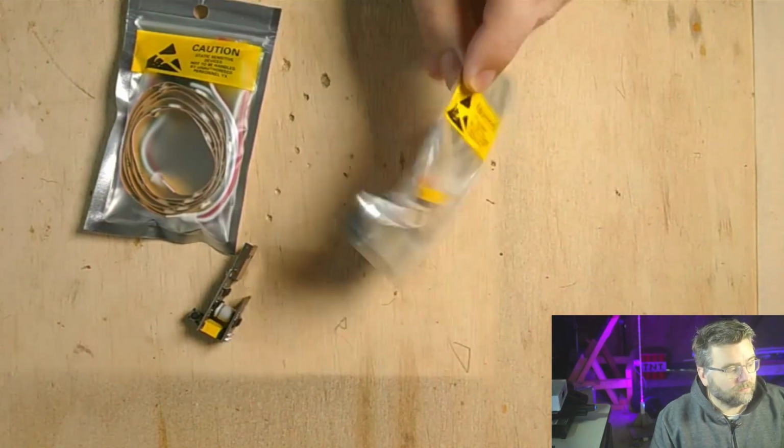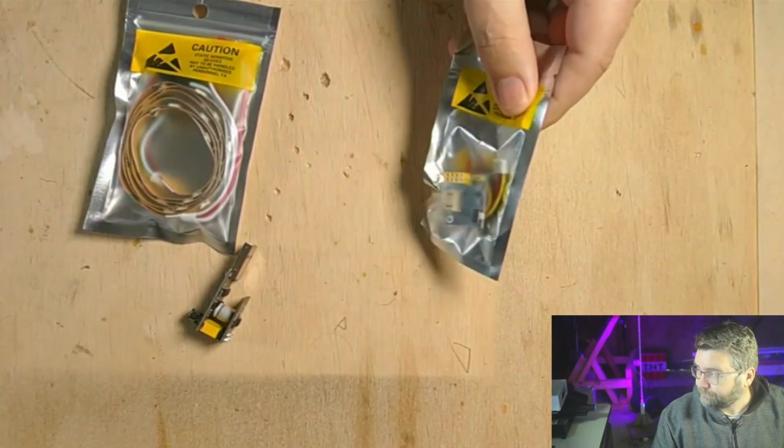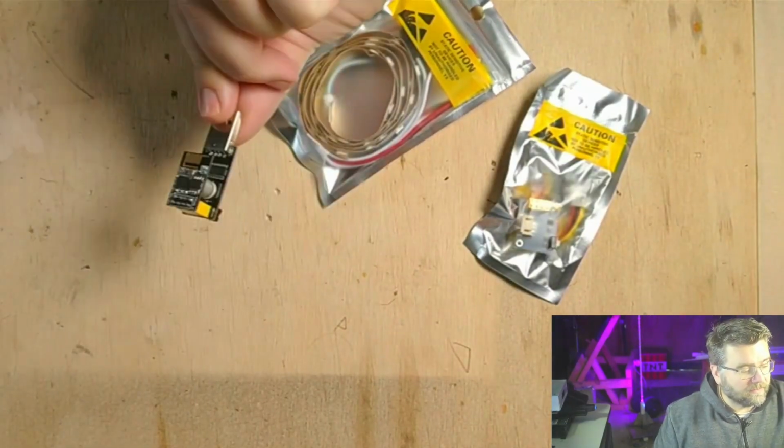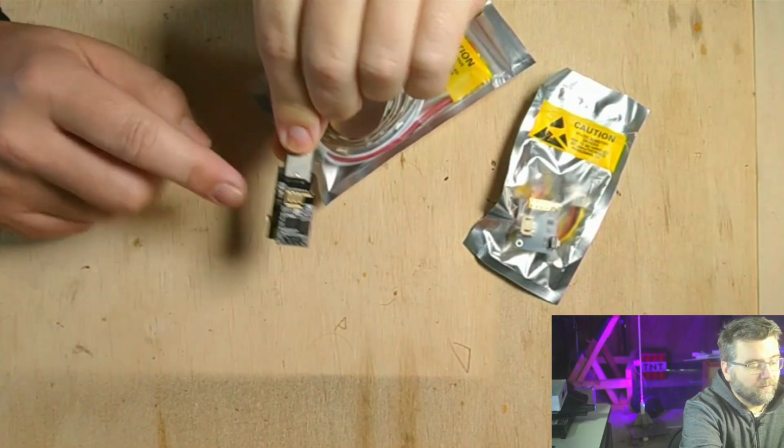We've got the little driver board here, the LED strip of course, and a programming jig with the ESP-01 on top. When you connect into a controller, you just need to connect one pin, and then you have to sort out the power for the LED lights, because you don't want to run the LED lights directly off the output pin of the controller, or you'll just cook it, because they draw too much current.